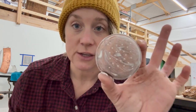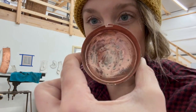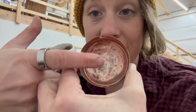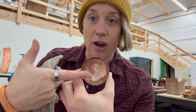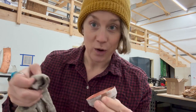Now, as you can see, the holes are clogged. But if you turn it around this way, you can see that the mud came inside. And now if I leave that there, even if it dries, once I put flux inside and then start to wipe around the tin, that drywall mud will smear as well. And wherever that goes, the tin doesn't go. And then you end up having nasty spots where you don't want it.